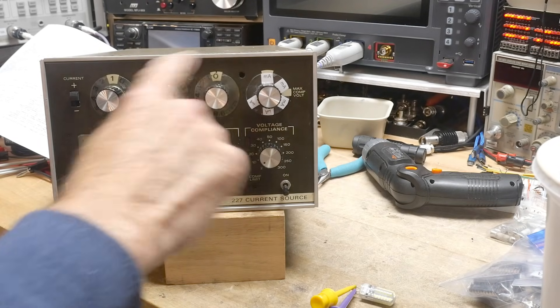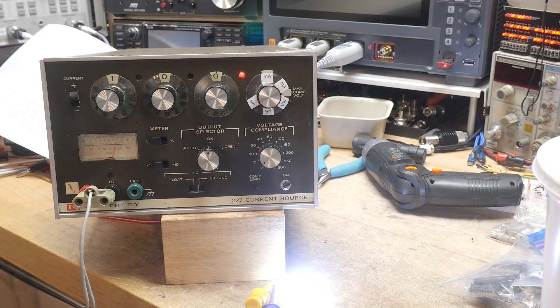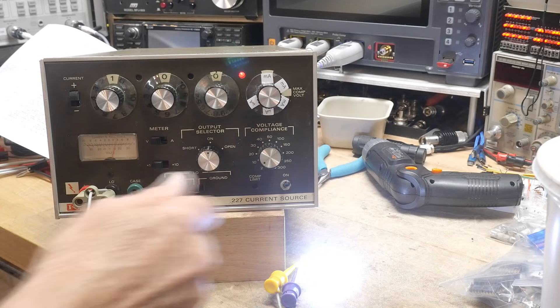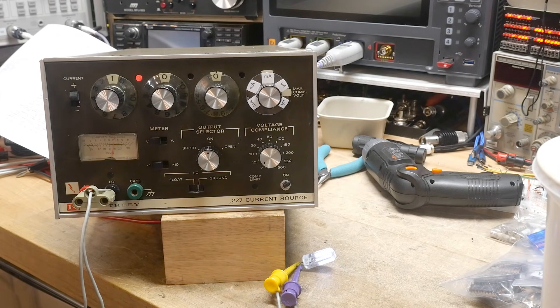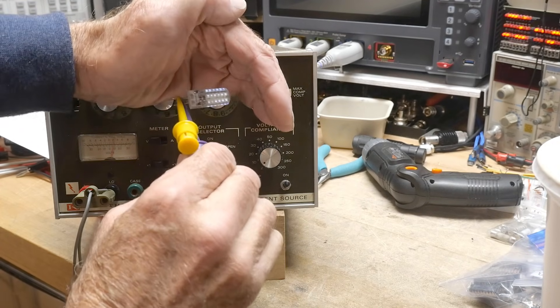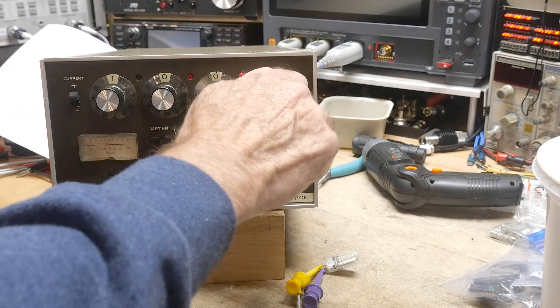I'm going to put it on microamps. I have 100 milliamps — I'm going to be driving an LED here. We'll turn it on and we get a very, very bright LED. If we go down a range, now we're at 10 milliamps. Go down another decimal place, now we're at 1 milliamp — not much going on there. We'll go down another one: we're at 100 microamps and it is just barely lit up. And now we're at something else and it's just not happy down at that lower range.